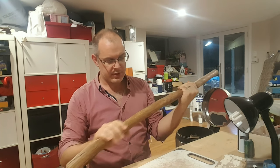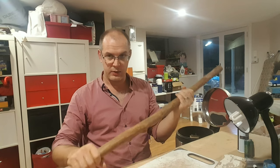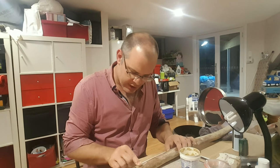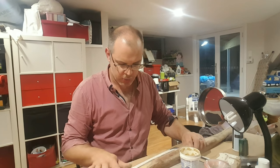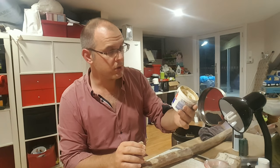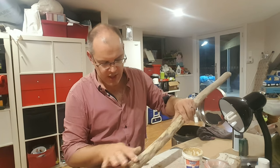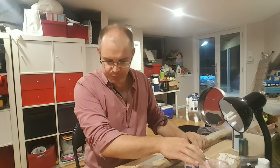It's sanded — I'll fill in all the gaps because it's an old piece of wood, and once it's all filled I'll varnish it and then put something on for the handles. I'm filling all the gaps with some Timber Mate, a water-based wood filler I had at home from previous renovations. It's really old and dry but it works. There's way too much filler there, but I'll be able to sand it back smooth again.